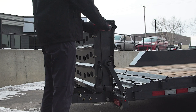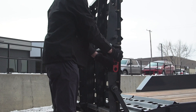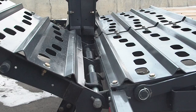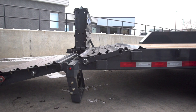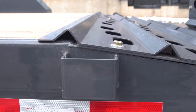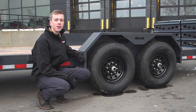The first step in unfolding the ramps is to remove the pin, take off the latching arm, grab the handle, flip the ramp up, use the red latch to lock it in place, and secure the pin. Then reach down and pull off the supporting arm, grab the handle of the ramps, and guide it down — the springs take the entire weight of the ramps so the operator doesn't feel any stress. On these full-width ramps is corrugated bent plate with cleats bent into the plates and large perforations that help with aggregate clean-out such as mud, snow, and ice, providing more traction when loading. The plates are bolt-on, so should you heavily damage one, you can remove eight bolts per plate and replace it for ease of maintenance.